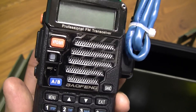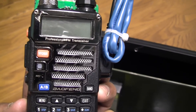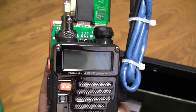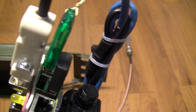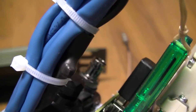The radio is a Baofeng UV5R — nothing fancy. All I really need is a radio that can receive and transmit; in a receive-only I-gate the transmitter isn't required. On the back of the Baofeng I have a Raspberry Pi 2 and a TNC Pi riding on top of it, plus a custom-made cable I made for the TNC Pi and the Baofeng.